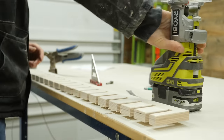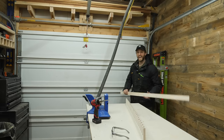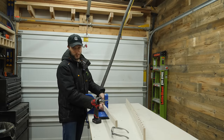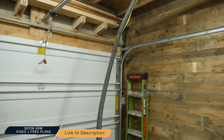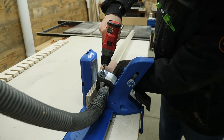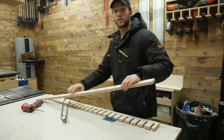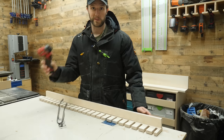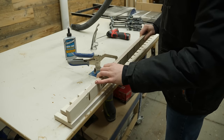Now that we've got the piece where all the clamps slide into, we need to attach it to a support piece to give it a little more rigidity. I'm going to take the smaller support piece, put it in my pocket hole jig, and drill out some pocket holes. By the way, if you want to build a boom arm that keeps your dust collection hose up and out of the way, there's a video linked in the description. Having the boom arm is great because the hose is no longer dangling all over the floor and getting caught in the workbench.